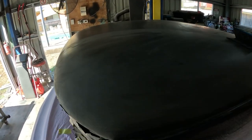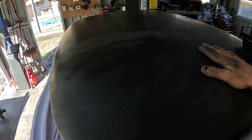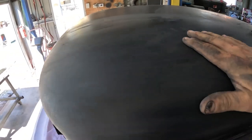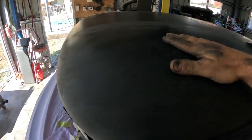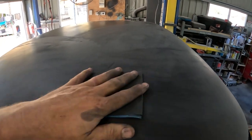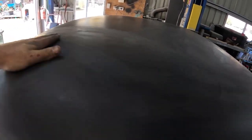I just wanted to take a second from standing there. Most of you out there probably know what I'm talking about. As you can see, as I'm sanding, like this over here is really smooth - that surface is smoothed out. But as you can see, as I'm transitioning up it's getting a bit ripply. So that's what they call orange peel when they're talking about paint. The idea of what I'm doing here is if I can get this finish as smooth as possible, then the top coat that goes on will be as smooth as it can be. So that's the whole idea behind sanding - it's not just to make the top coat stick, we want to get the surface as flattened out and as smooth as we can. I'm going to keep going and try to get this orange peel got rid of.